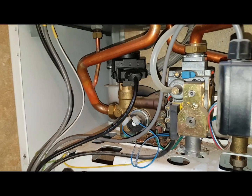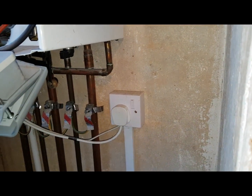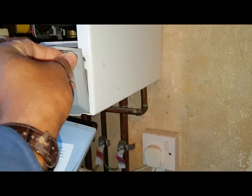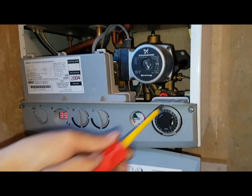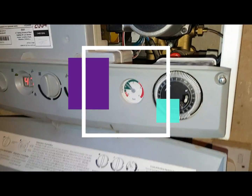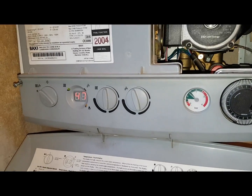That's it — clips in, great. Now we're going to turn it on. Switch on. We've got a fault there — the pressure had gone down. So it's back on, we've filled it up. The flow pipe's getting hot now, so that's going around the heating, and the temperature's going to stay. Excellent.